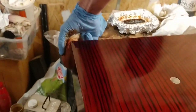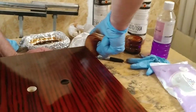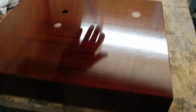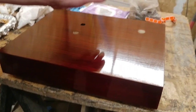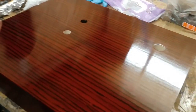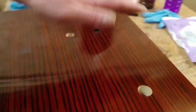This has had so many coats it's unbelievable. The idea of denibbing is because you get slight imperfections in the air — bits of dust settling. It's very difficult unless you're doing it in a spray booth clean room. But it doesn't matter because you get rid of it in the finishing process. Look at that finish — it looks really really nice now, with a real luster. You can see your hand in it. Once finished, this will be like a highly polished Porsche car. We'll leave this to dry for a couple of days and then come back for the final buff.